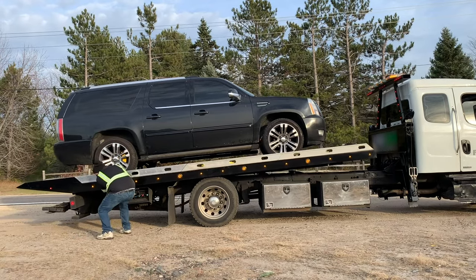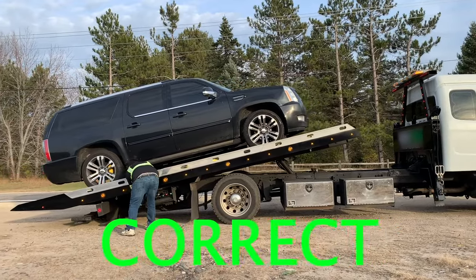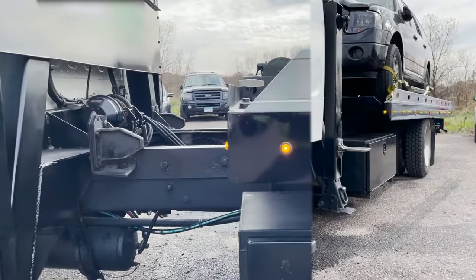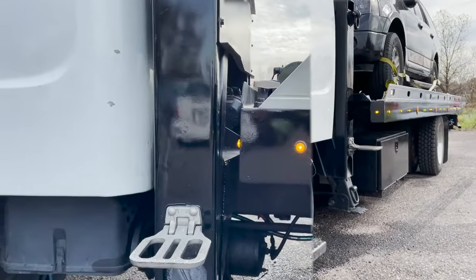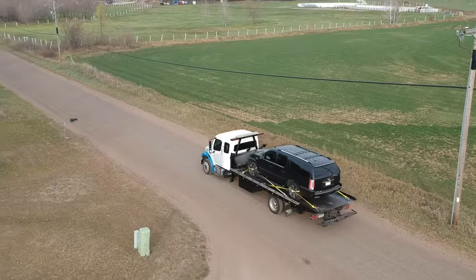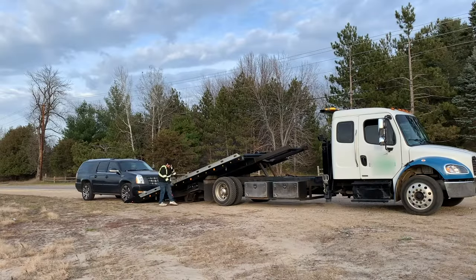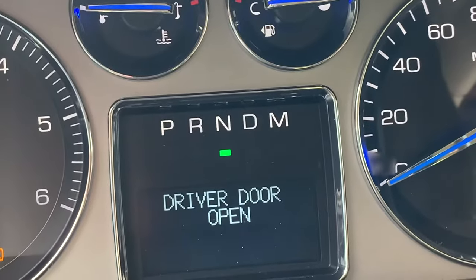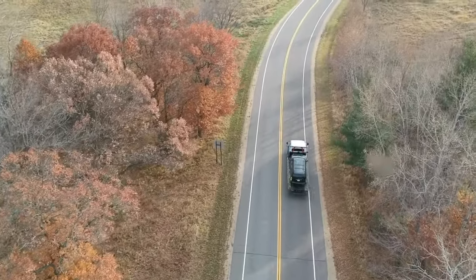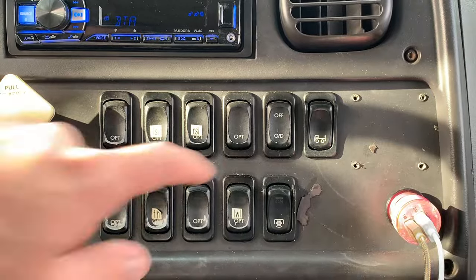When you tilt down, the flatbed's rear axle should be directly in the middle of the inoperable vehicle. Now that you've got the bed tilted down, finish rolling it all the way in, making sure it locks into the bed locks. Finish strapping down the other two wheels. If you're on a busy highway, just take the next exit and find a parking lot before strapping down the other two points. To keep jerking and tension off the winch cable during transport, loosen the winch up a little so it's not so tight. Pay attention to where your hook is — you don't want to puncture an oil pan or crack the customer's bumper. Remember the vehicle is still in neutral, so if you don't have your load secured properly, it could shift during transport and come off completely. Once everything is secured and you're ready to go, lower the RPMs by simply hitting the brake. Air the bags back up and shut your lights off.